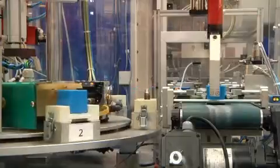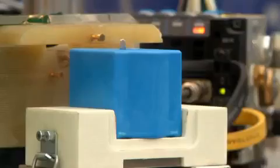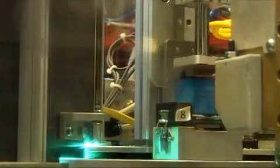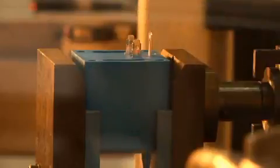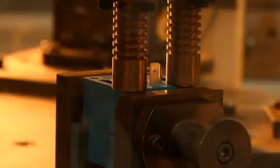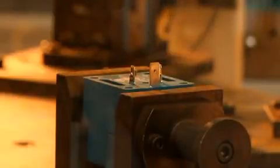After the molding process, the coil is voltage tested. When the coil passes the voltage test, it is stamped with the code number and Danfoss logo. A threaded insert for the plug is inserted into the coil. The coil plastic is melted to secure it in place.